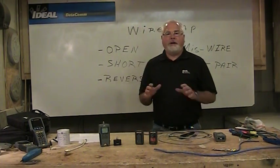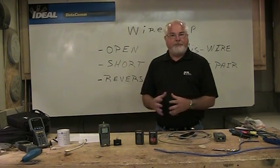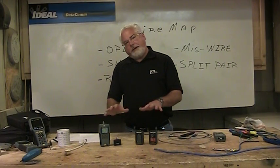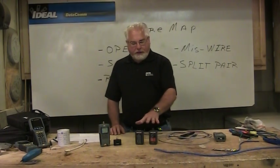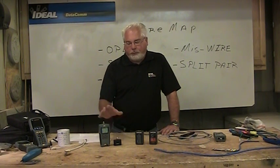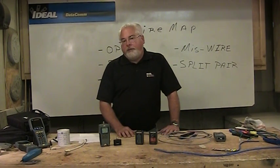In this segment, I'm going to talk a little bit about some of the basic Datacom testers we sell for testing category 5E cable, and actually this one will do more than just that. When I look at these basic testers, they're testers I can really afford to give to just about anybody in the industry. Both these testers are referred to as wire map type testers. We have the Link Master type product, and the multimedia VDV meter, which means voice, data, video, so it does coax, phone, as well as category testers. But again, both these being basic wire mappers.